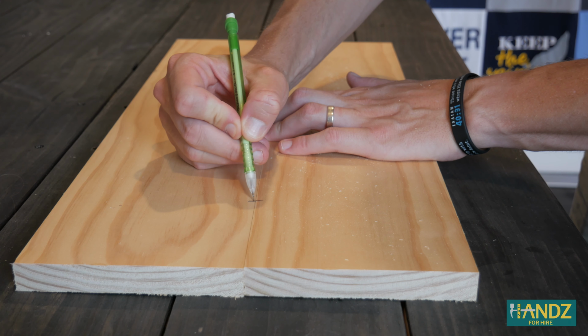Okay, this is the Ryobi biscuit joiner, and you can see there's a blade right here. And you essentially lay this on the board, and there's a center guide right here on the top, and I'm just lining it up with that line that I made on this board. You hold down with your one arm tight on this grip here. You start the blade up. And you push it in and you've got a perfect cutout. We got two. And here's our final one. Take our clamps off. I don't know if you can see that, but we've got our three biscuit spots now.